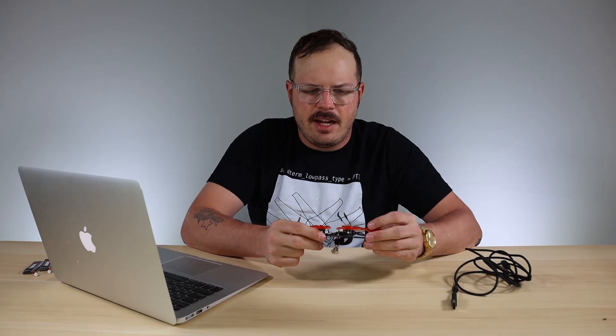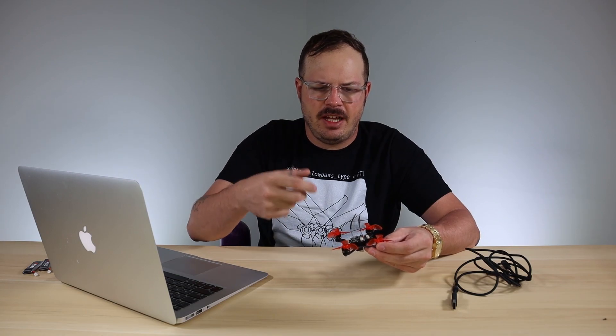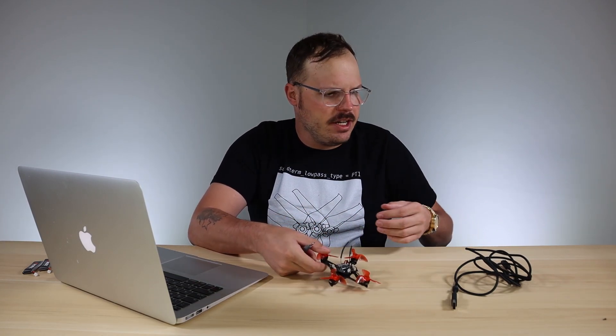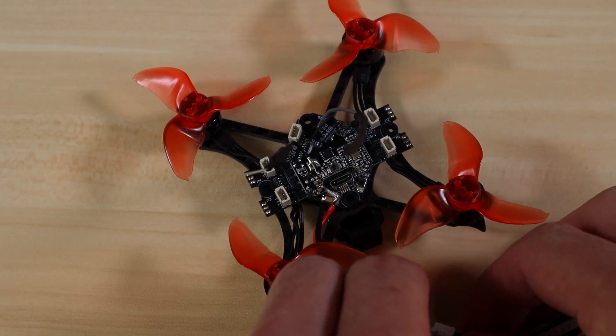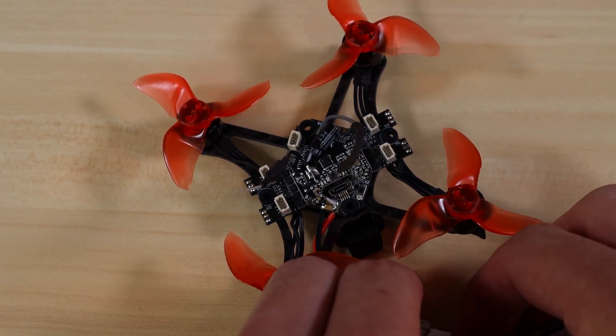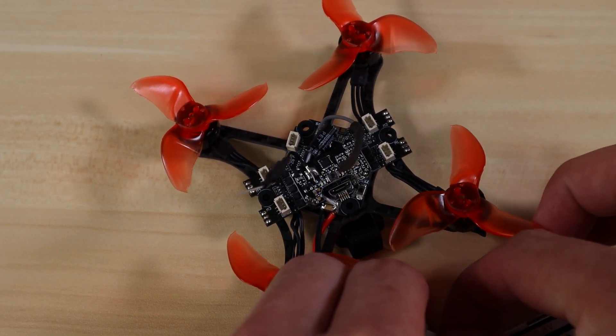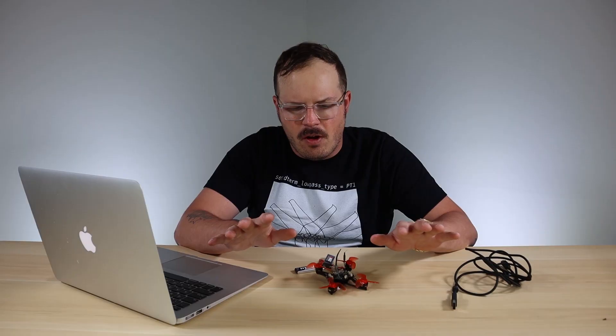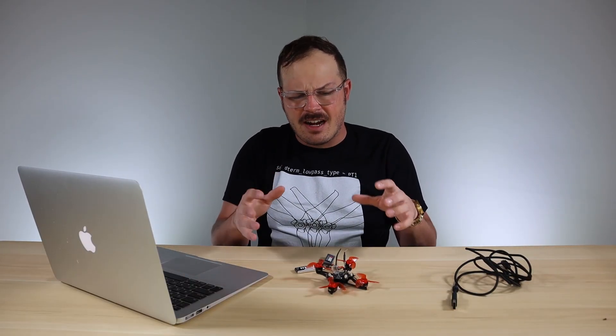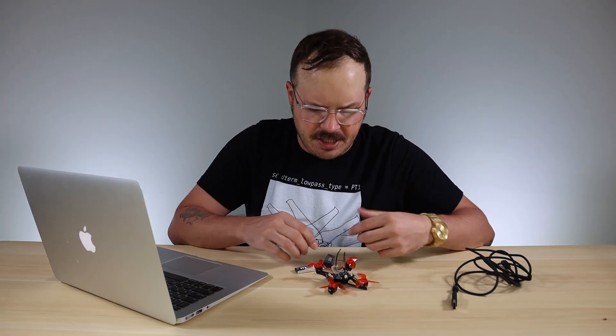Now I have the canopy off and you can see the board clearly. I'm going to show you the issue I mentioned where the VTX will only light up by itself. When you plug the drone in, you'll notice you only get the VTX lights and you won't get the red or blue flashing light on the board. If we plug both batteries in, only the VTX lights up — it goes through a sequence of blue flashing lights, then green, then red, and then goes dead. So with no lights on my board, this is where you'll have to use DFU mode.